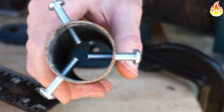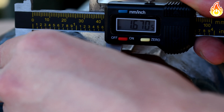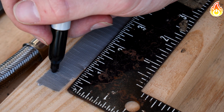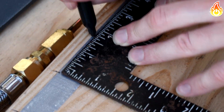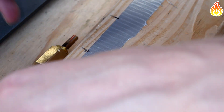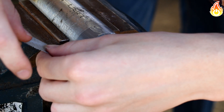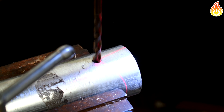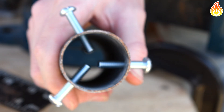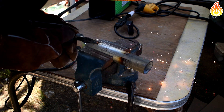We decided to use our machine screws to center the nozzle — we're going to put them into the pipe to hold the nozzle centered. We measured the diameter of our pipe and used a little bit of math to calculate where to place the three machine screws. We marked the spacing on a piece of duct tape and wrapped it around the pipe. We drilled the holes in the pipe, did a test fit — they lined up great. We then went and welded the nuts onto the pipe so that the screws will stay in place.